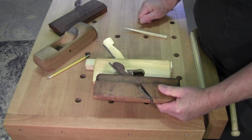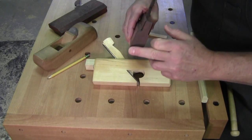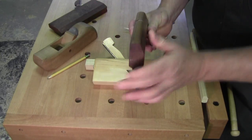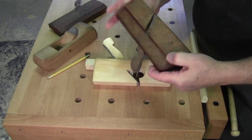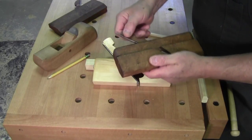Let's say you go to a flea market or an antique store and you buy yourself a molding plane. You always want to check: make sure there are very few cracks in the end grain itself, and make sure the plane body is not warped, twisted, or bowed. But you get it home and the iron is stuck.